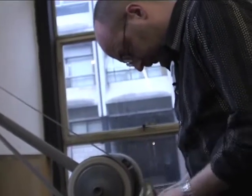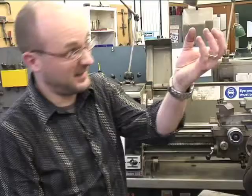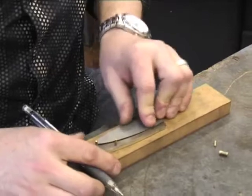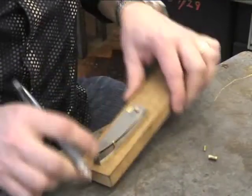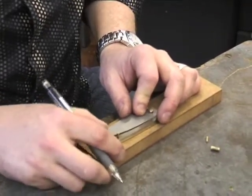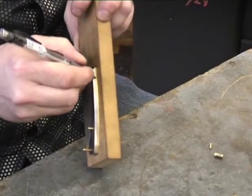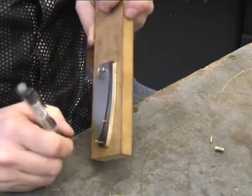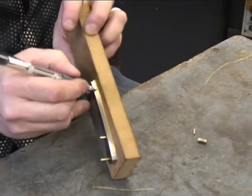That's the bit that's really hard to get right just by using templates and drawings — it involves lots of squinting against a white background. It was then a matter of setting the spine against the underside of the tang so that the blade shuts with enough space not to forever keep dulling itself, and at a point where the spine is flush. That involves nibbling away at that region until it's almost down.